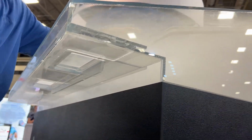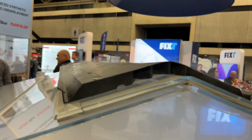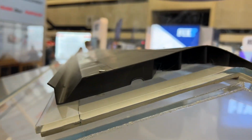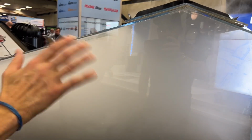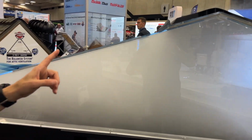And we're going to look back at the peak of the roof. And now we're seeing some movement. Now the heat and the moisture is rising and exiting through the ventilation. But we're going to make this even a little bit better, because right now there's no wind. It's just thermal effect, thermal buoyancy. Every vent moves air through thermal buoyancy, but the wind is a stronger mover.